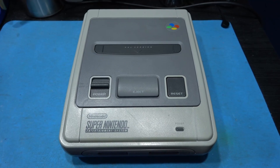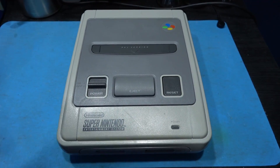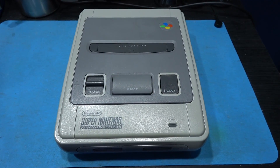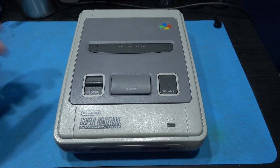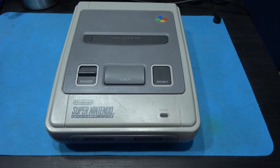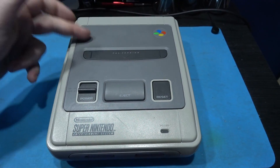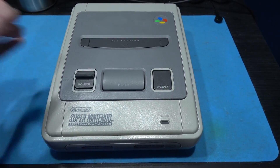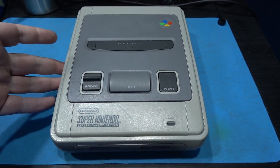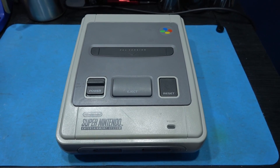Time to get into the SNES - no, I'm not going to film that. I've already shown you how you can get into a SNES if you watched the previous video where I repaired this console. What I want to explain is something very important: when you're going to work on a SNES, you should always power cycle it with no power connected. If you look, the SNES is unplugged, but watch what happens when I throw the power switch - watch the power indicator come on for a brief second. There's power in the SNES even though nothing is powering it, and you need to power cycle it to get rid of that excess power. Otherwise, if you short something while working on it, you can damage the SNES. So just power cycle it before you work on it.